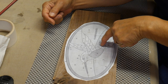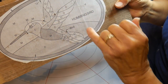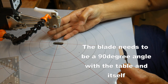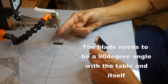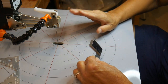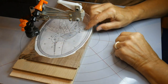I'm going to drill pilot holes in areas where I think I'm going to need extra room to turn. I have my pilot holes located where I think I might need them — you can always add more. You put the pilot holes in the waste, not in the bird. It doesn't matter what scroll saw you have; you want to make sure the blade will be at a 90-degree angle. This is crucial in order to get all of your pieces to fit well. I chose a Pegas MGT number 5 for my blade — don't go any lower than a three, but the smaller the blade the less of a gap there's going to be. Once it's secured in your scroll saw you need to check for that exact 90-degree angle, both front to back and on the side.